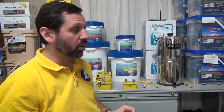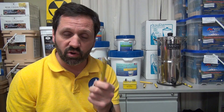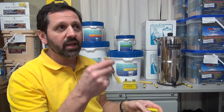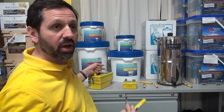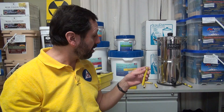Power plant workers, nuclear power plant workers — some people in the industry still use this type of thing. It's the most important item on the table because it tells you your total accumulated dose. They'd find out when radiation levels got low enough, say it's safe to go outside, and you wear this in your pocket because gamma rays go right through your body and walls. You don't have to point it at a source — when you're exposed, it gets exposed. The instruction would be get back to shelter before it reads 30 or 50. When it got up to maybe 20 or 25 they'd say we better get back, it's starting to get hot. So you can get a safe amount of radiation without your body being damaged.